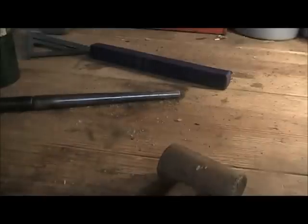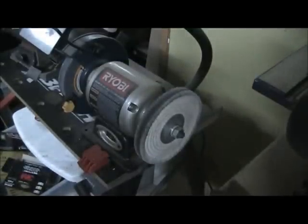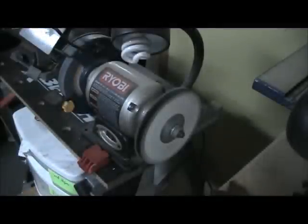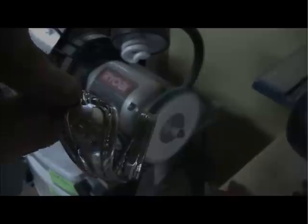One last part I forgot to mention — buffing your ring. I have a buffer attached to my bench grinder and this is just some metal buffing compound from Ace Hardware. Buff it out. Remember that the buffer creates more friction than sanding with sandpaper, so now we've got a nice shine to it. Just remember — you can grab some hot stuff off the buffer and you'll be like, 'Oh shoot, I didn't know it was that hot.' So there you go — spoon ring. Thanks for watching.